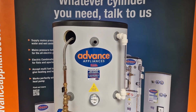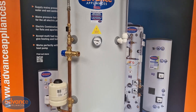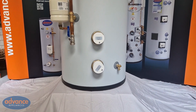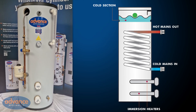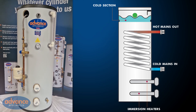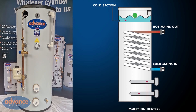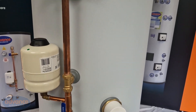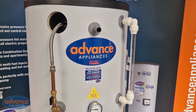In this video we are going to look at the ETS electric thermal store and the common reasons for low volume or no hot water. It is worth understanding how the ETS works so that the test process in this video makes sense. The ETS provides instantaneous hot water through a coil internal to the tank. The store of water is heated to around 75 degrees C and as the cold water passes through the coil it is heated and supplied through the mixing valve. We will now look at some of the possible reasons why this process is not happening and see if we can rectify the low volume or no hot water issues.